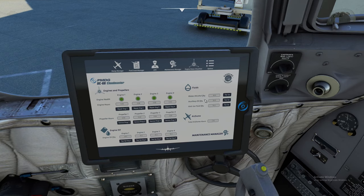You might ask, what is the water alcohol for? On a wet takeoff, that's what you use the water alcohol injection for — we'll get into that in a later episode. For the auxiliary oil: the DC-6, unlike a lot of other planes — I always say you add the oil and check the fuel — burns a ton of oil. So you need an auxiliary oil tank on board to top off all your engines while in flight. We'll talk about that in a later episode as well.